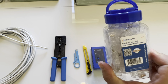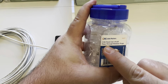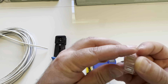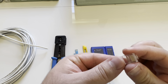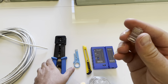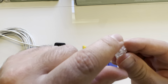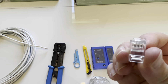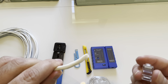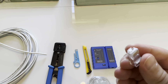Then you've got these pass-through cable connectors by Cable Matters. I absolutely love these connectors — these are crimp connectors. What's so nice about them is that when you slide your cable into these connectors, the wires actually go through and come out the other side. There are cutouts on the end, and the tool itself has a blade, so when you crimp it down it cuts all those wires flush. What you're left with is a really nice connection where every single wire inside the cable jacket is connected to that connector. Big time saver. They're relatively inexpensive and you can get these on Amazon.